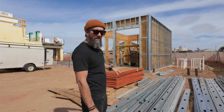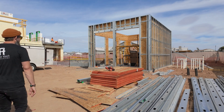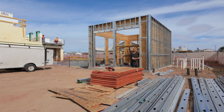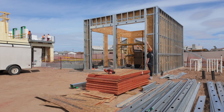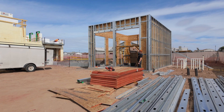With this construction, you can see the king studs, the stringers, and the headers. They're putting in the OSB right now, so you can see how large this building actually is. I am 5'9" and we've got the king studs going all the way up — the headers above attach to the metal structure, and the OSB on the inside is going to create strength and stability. I imagine we're going to be putting in insulation here as well. More to come on that — stay tuned. This gives you a good idea of what's going on in this structure.